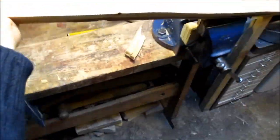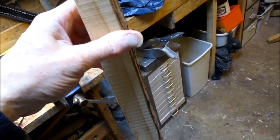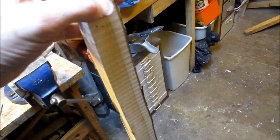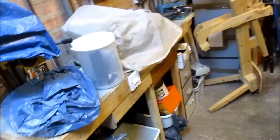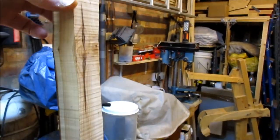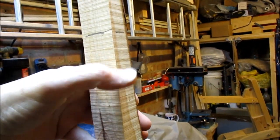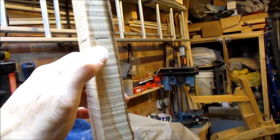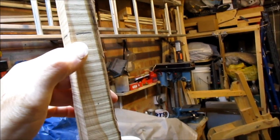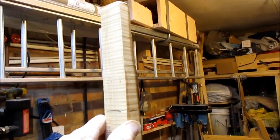Having got the first rough-out done on this youth flight bow, I've looked at some of my other flight bows for reference, which is always a handy thing to do. They come up to me nose roughly, and relative to that big knot, that's not too bad. So I'm allowing a bit extra because this is self-yew, whereas the other flight bows I was looking at were bamboo-backed yew. Always add a few inches extra, because you can saw it off later, but you can't put it back on.